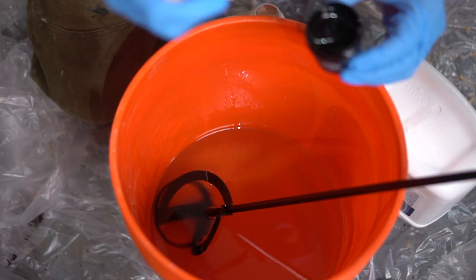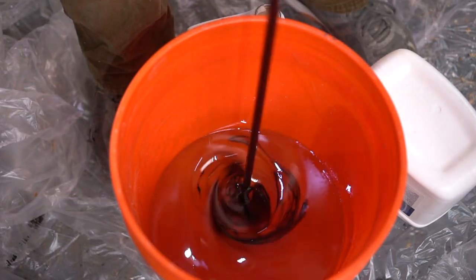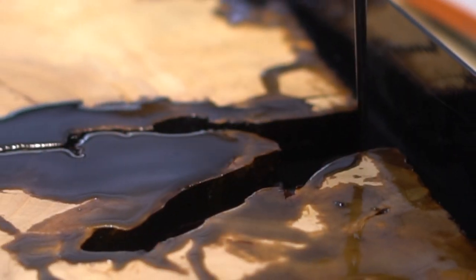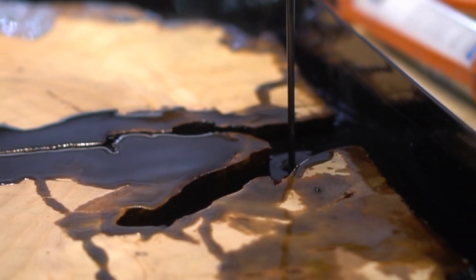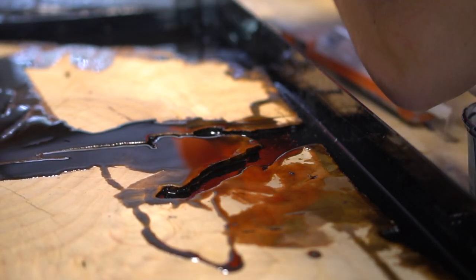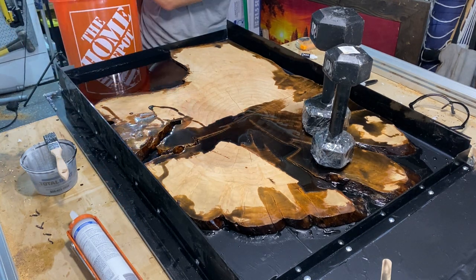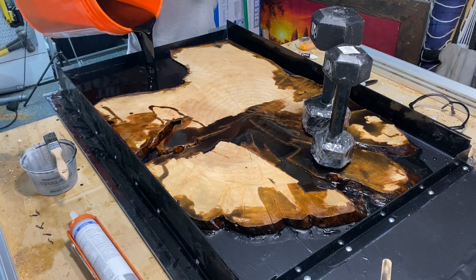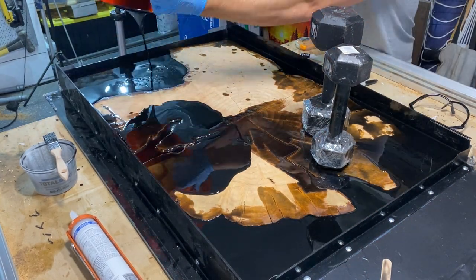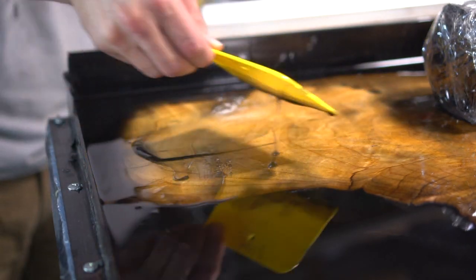I don't have an accurate amount of pigment I use per gallon kit, but I used at least five spoonfuls of the opaque pigment, which when mixed thoroughly gives a very dense black look. Something about pouring epoxy on a wood slab is just so inviting and enticing. As for pouring, I'm basically pouring into both ends and hopefully it all mixes together properly in the middle. Once fully poured I do wipe off some excess epoxy on the wood, though it's not entirely needed since we still need to flatten this.